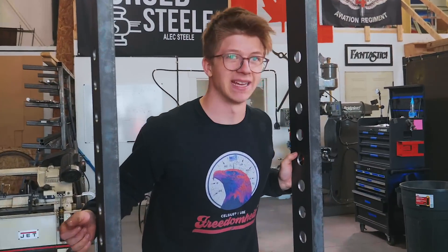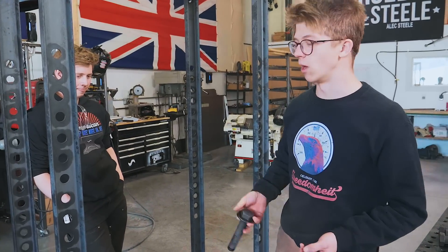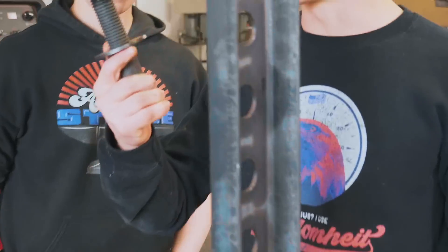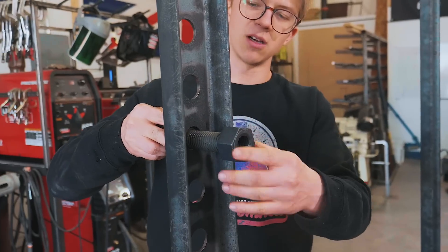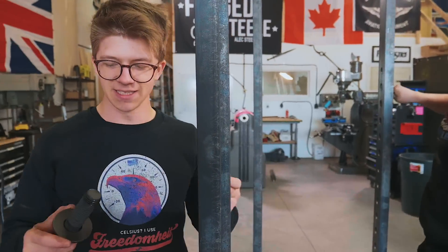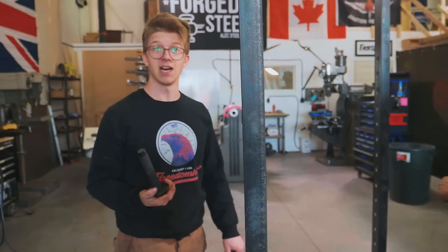This thing is big — this is a big squat rack. The frame is done. We now need to work out how we put stuff onto the frame, such as the bar holder for when you're actually lifting. As per the Mark Rippetoe Starting Strength design, we've got a threaded bolt — we're going to weld on this washer, it goes to whatever height you want, it stops, and you throw a nut on the back. We're going to thread this nut on until it gets to about here, use that to hold the washer in place, weld around it all, and do that four times to get ourselves some bar-holding brackets.